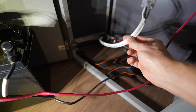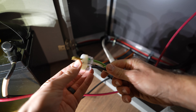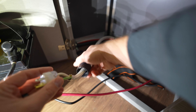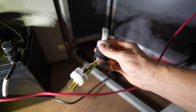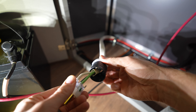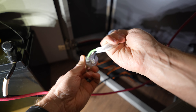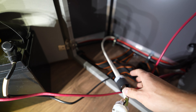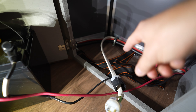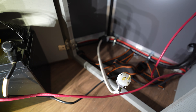So this is how we're doing this. We've got the wire that we disconnected from the port out there. I grabbed one of these plugs from an auto parts store. We put a male end on the end of this — this is the house power, the shore power plug that was going outside. I just disconnected the end of it. This will slide over the top; you can see the wires go directly into the back of it. Then this will slide right over it, I'll tie that down, and then I'm going to get a wire for outside coming in that this can plug into so we can still use shore power, or this can plug right into an inverter inside.